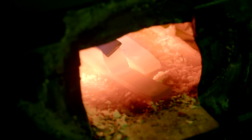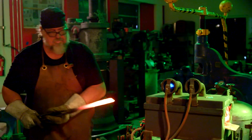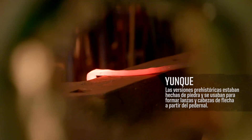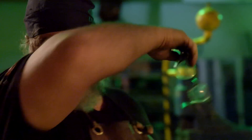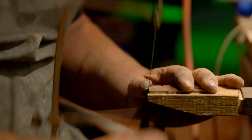When I saw the artwork that Blizzard Entertainment supplied, it showed only two bands. The places you're going to hit with a hammer are these corners, so I'm going to reinforce them — adding four bands as opposed to two. I'm just going to soften the steel at a red heat so I can forge it underneath the power hammer, then take it to the anvil and bend a 90-degree angle.